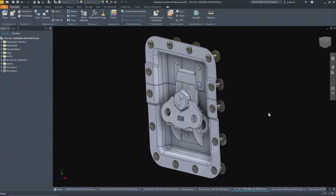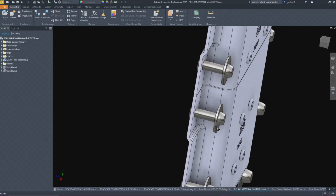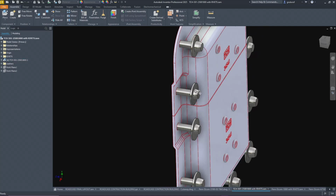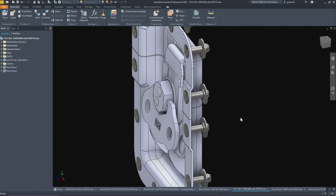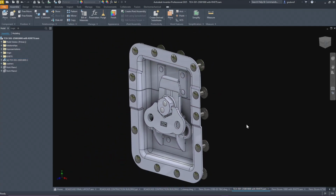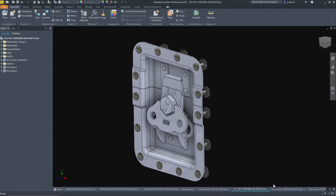Let's go to these, just to make it faster to assemble. I already put the rivets in. You'll see these are a little different than the washers that are here. I just offset them so it would just show through. Same thing, you think ahead, these rivets are not long enough to be able to mount this because of this extra angle that comes up that goes around the tongue and groove. So I did this so I could just slap them on. If I was going to do a part list, I would have to put these in one at a time in the full assembly, so when the part lists come, I have a proper count. So that's another thing, but I'm just doing this.